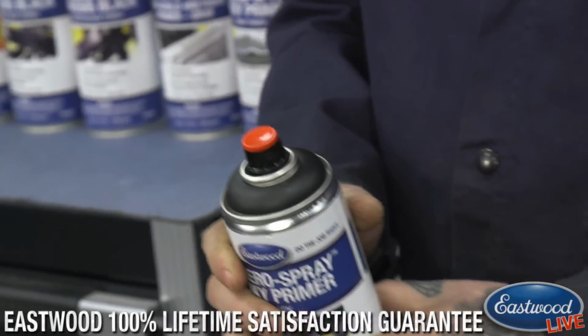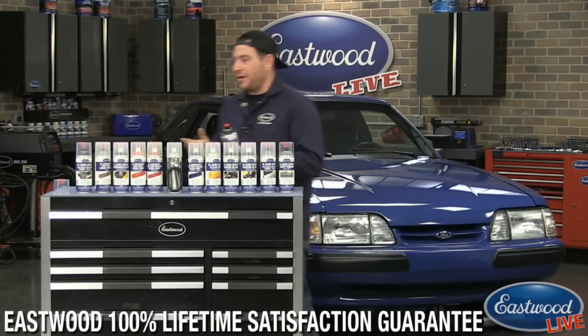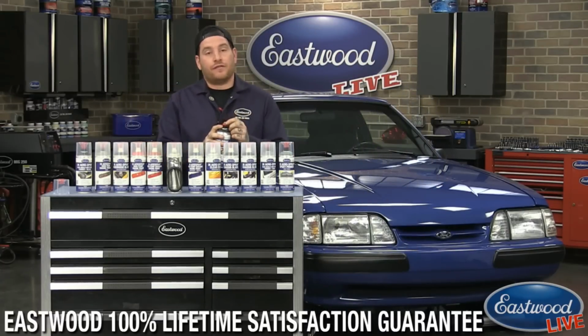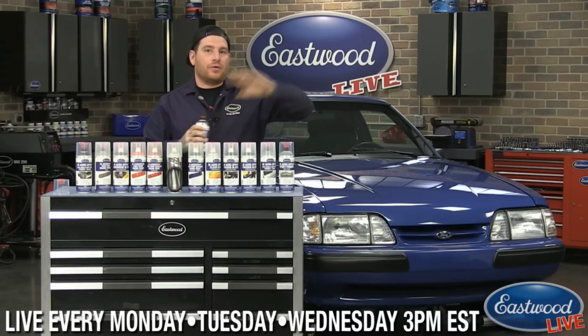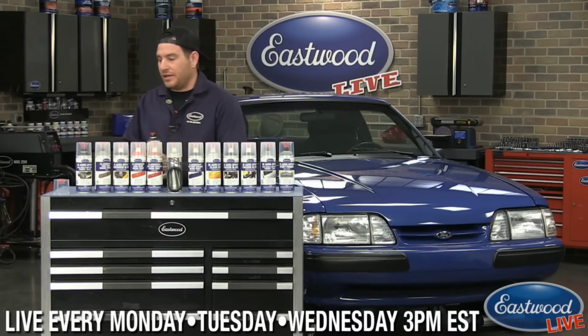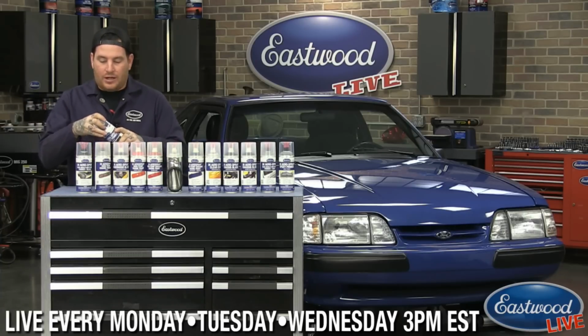So if you're spraying something that you need more of a narrow pattern on, and you don't want to waste material, you definitely want to turn the fan pattern down so you're getting a more narrow fan, and you're not wasting material with a ton of overspray on something that you don't need to, or you're getting dry spray on something because of the overspray.